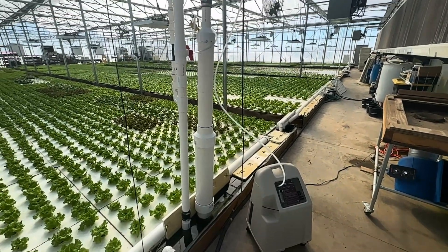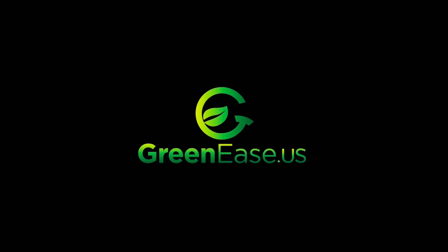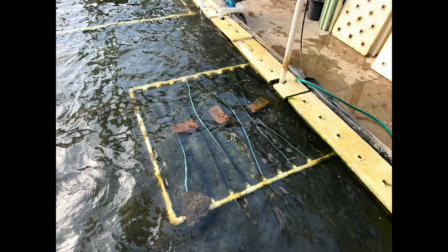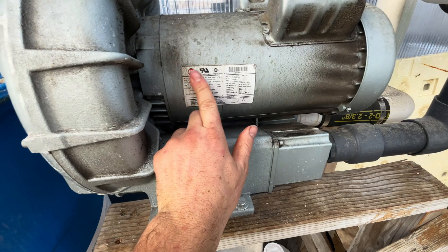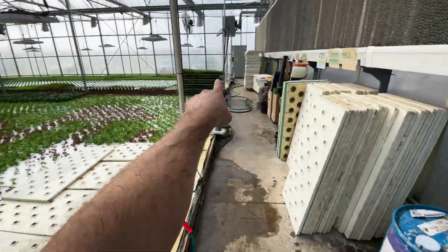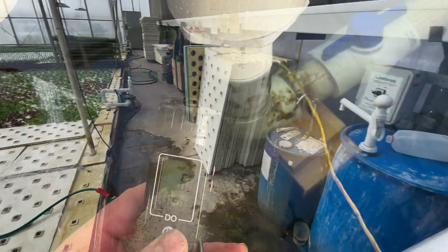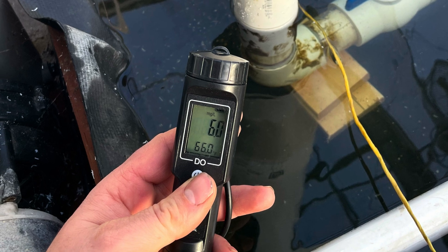This is the most efficient way to get dissolved oxygen into your hydroponic system. Over the years, we've tried a lot of different ways to get our oxygen levels in our water high. We used to use a hose system, but we spent about $200 to $400 a month keeping the hoses replaced to keep the system operating at a premium level. The hoses got clogged and there was really no way to get them cleaned out. We used a really expensive regenerative air blower that made a lot of noise and was expensive to run.